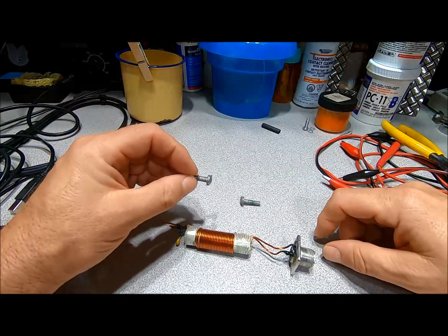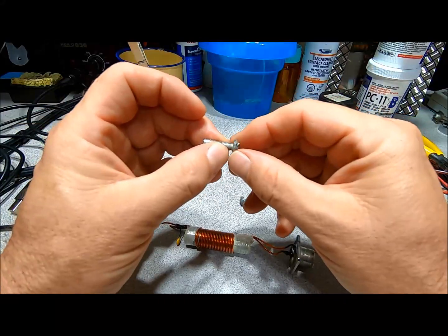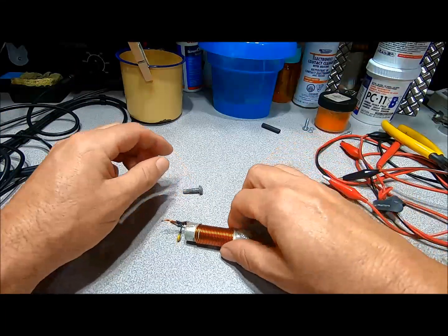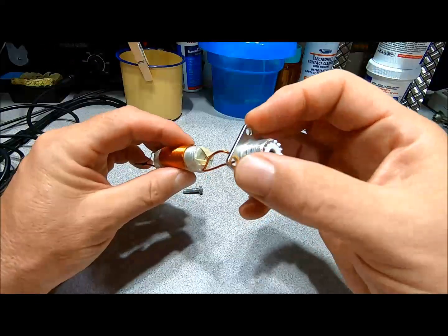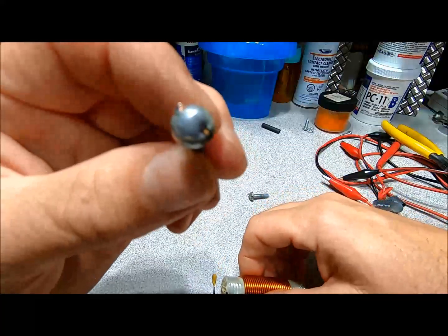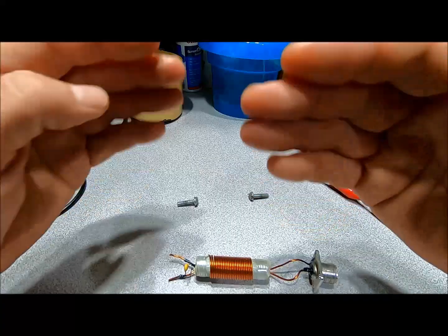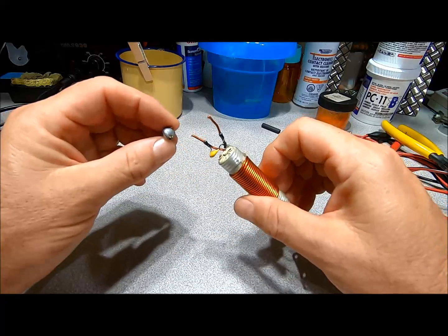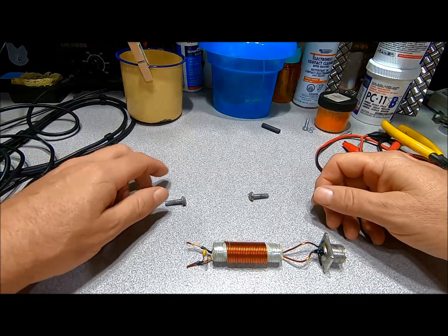Here are the screws that were the terminals in the balun. When they assembled it, they took a piece of PVC, knocked two holes in the side, put a star lock on it, slid it through, and used a nut to affix it — these became the terminals. Then they took the balun assembled, slid it through the bottom of the PVC, and used sheet metal screws to tighten it up. They applied a ton of heat to direct-solder the magnet wire. When that window line was swinging back and forth, it caused these contacts to fracture internally — that's why I had a 13:1 SWR.